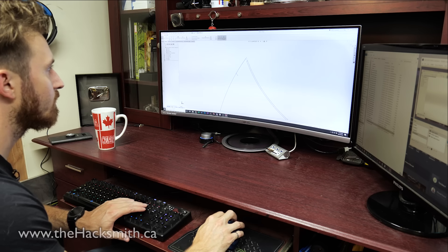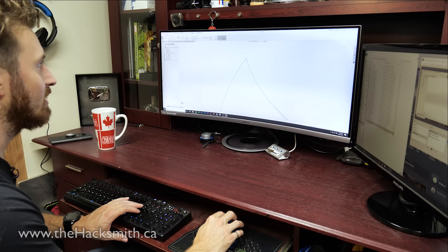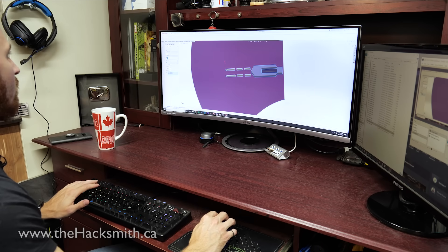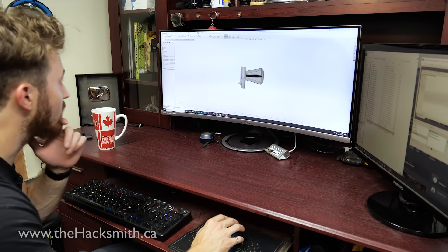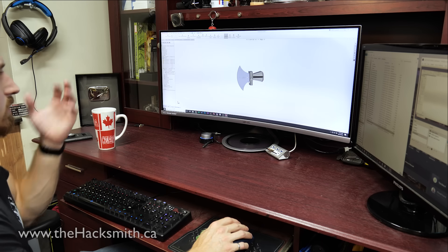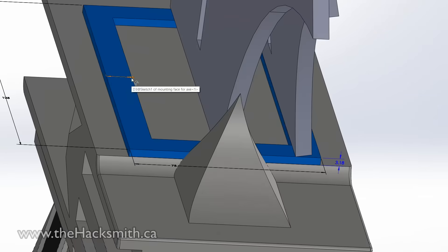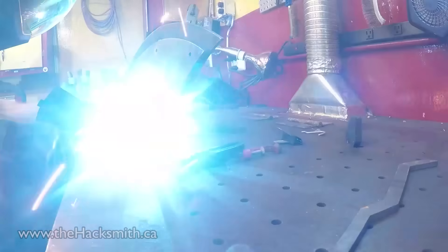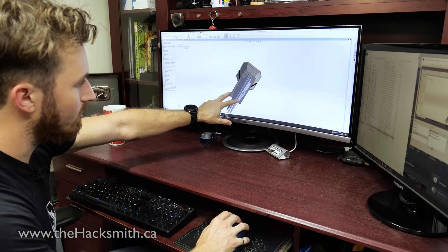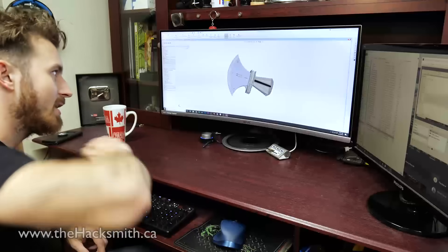So we've got this. The only unfortunate thing with a sketch like this is nothing is constrained, which means if I click and drag a point it messes up the whole drawing. We're going to make this out of quarter-inch steel. Alright, so we've got the axe blade now with three holes. Now I'm going to rebuild it with my new parts. There's the center blade. The idea will be to weld this onto this bracket first and then tack weld these on here. Using a bolt, we can actually squeeze the blades together and hopefully bend the steel as well. Then we're going to fill in the entire crack with a weld bead and then sharpen the whole thing.